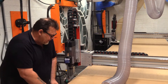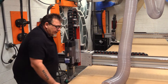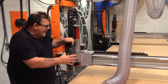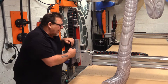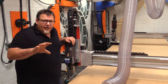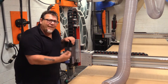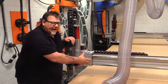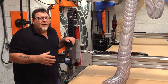Mounting it is really simple. This plate mounts right on here, which leads me to this: you have to have the extended gantry and the big spindle for this particular dust collection system to work. You need to mount your spindle all the way to one side of your Z plate, so you'll need to indicate when you buy it whether you want it mounted on the right side or the left side depending on what side of your machine you're working from. In this case, this is the right side of the machine — that's where we mount our dust collection.